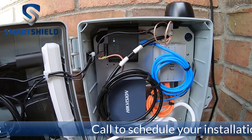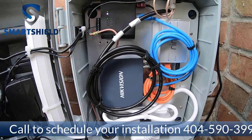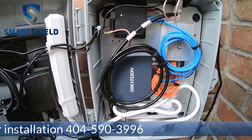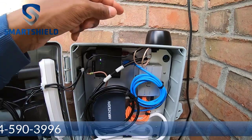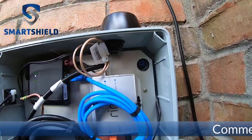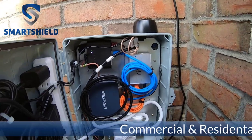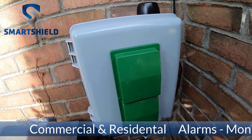For those of you that may ask why we have a five-port PoE switch - it's in case we want to do future expansion. The customer may want to add some cameras out here, and we may also add some Wi-Fi out here with some Eero devices. This particular person wants to do some smart lights out here controlled from his Lutron that's in the house. This Ring access controller comes with the cell antenna which we mounted to the top of the box - Ring did a signal meter test on it and it worked pretty good.